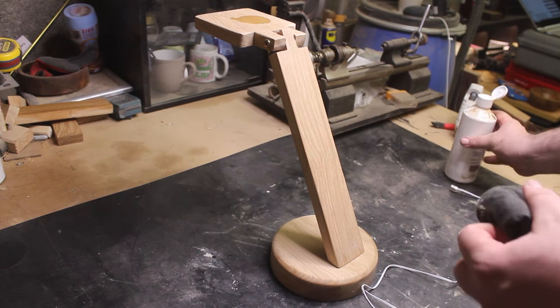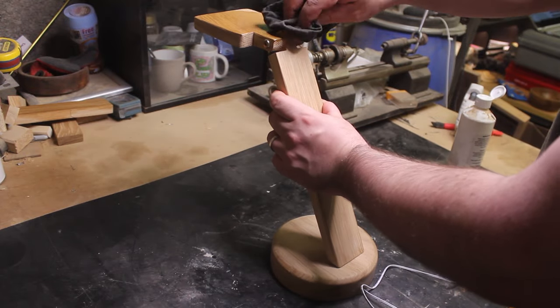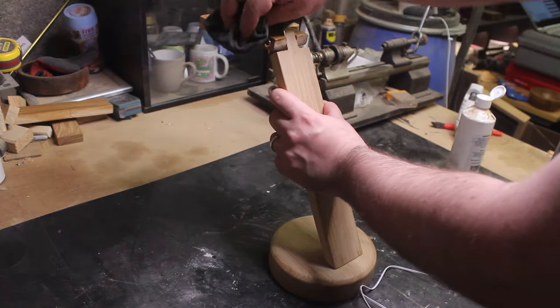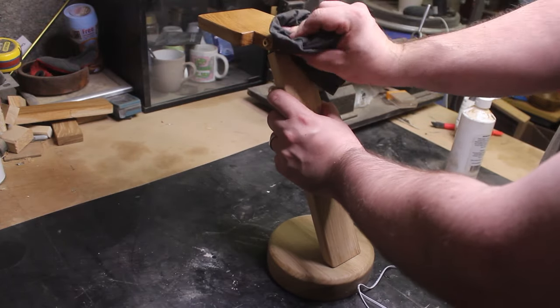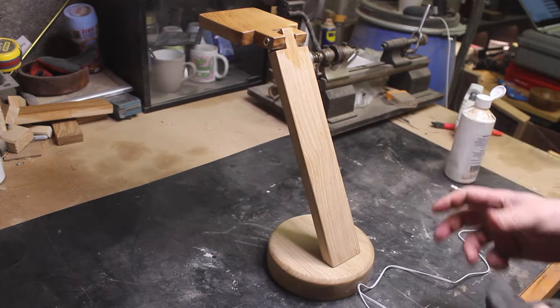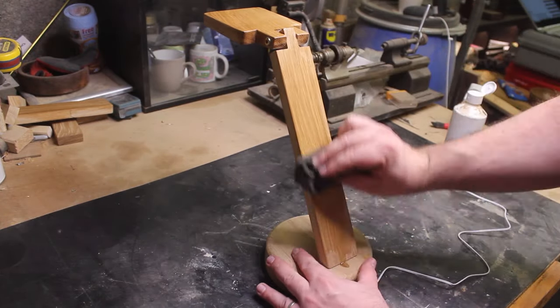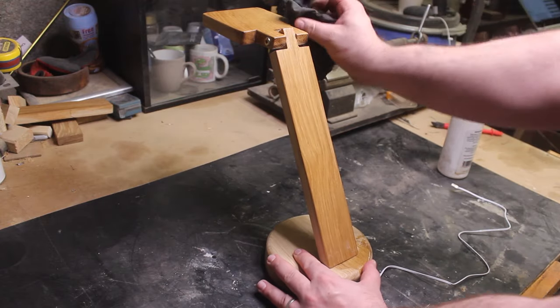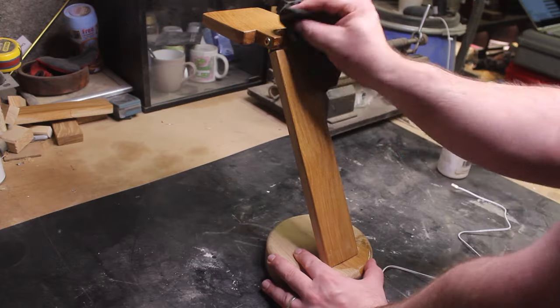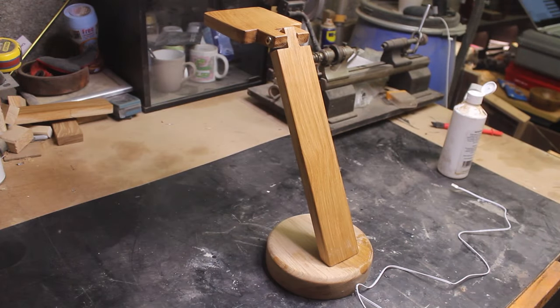The final task was to get some mineral oil on the wood to give it some protection. I quite like what it does to the grain without changing the colour too much. This may have been easier if I'd been able to do it with all the pieces in separate parts, but that wouldn't have worked with filling the cable groove with epoxy. So it just took a bit of time to get the oil into all the little corners, making use of some cotton buds and different bits of rag to make that happen.